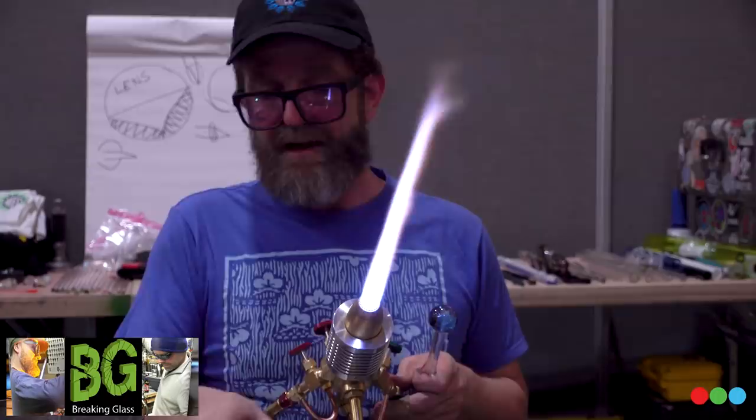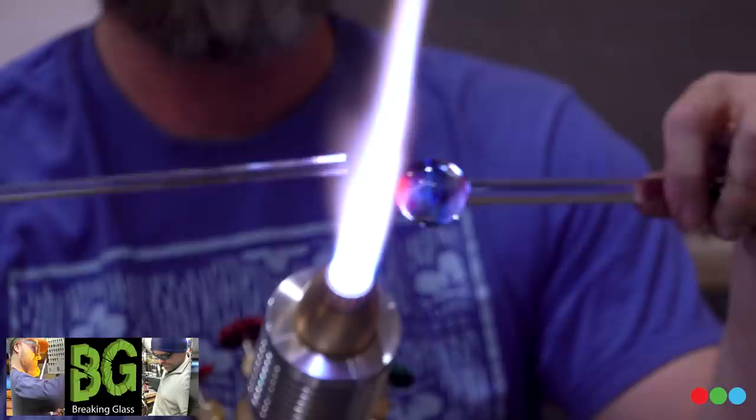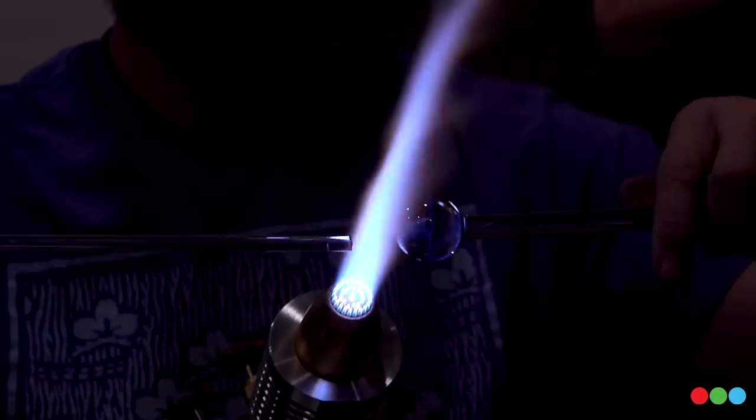Coming in with our cold weld. Medium flame — not just our center fire for this. We want to break in on both sides. We're just going to see a little color coming to the tip of the rod. Your marble already has heat, so often when you go to do this, your marble will get color right away and your rod won't. Sometimes it's worth it to get a little bit more heat in the rod before you make that attachment.